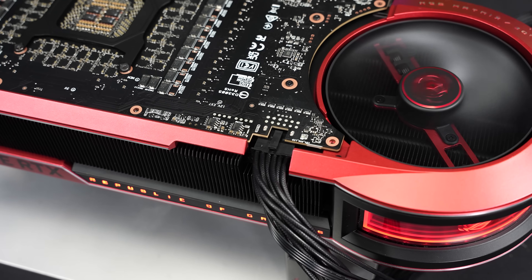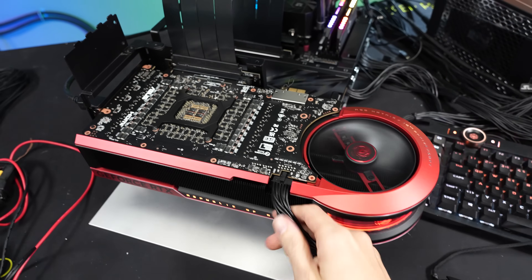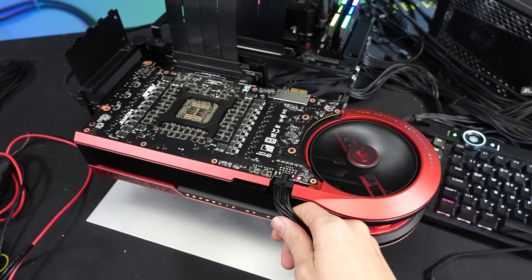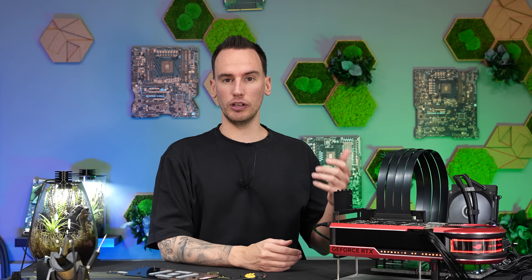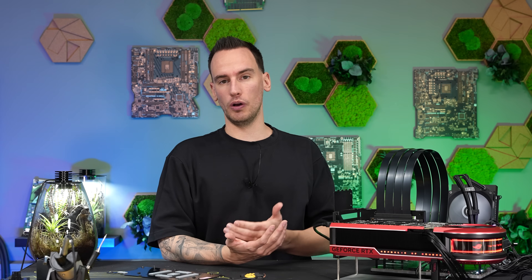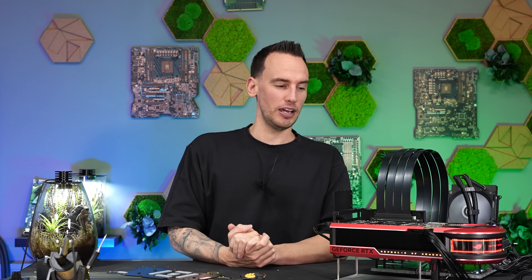Zooming in on the 12V high power connector, you can see the LED there is complaining because it's running far out of spec — but it is working. I can also feel it: if I touch the cable, it's quite warm. Obviously this is a modification I would not recommend running daily because it's just running the cable so far out of spec. But it shows you what is possible with the technology once you understand it. This kind of video is also meant to educate you — to understand how sense pins work and how you can play with them to, for example, fool the card to run full power over the 12V high power connector, even though this is absolutely not recommended. In the end I had a ton of fun playing with this card. I'll now have to send it to another German YouTuber who is next in line to review the sample. I hope he has fun with it, and I hope you also had fun with this video. See you next time.